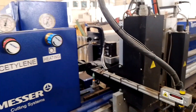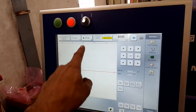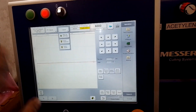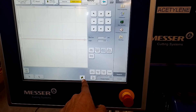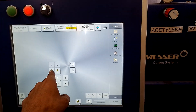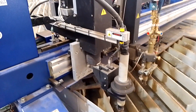It will go back. Now first thing you will do — you have two options: plasma and oxy. You have done X axis and Y axis moving. The second thing you need to check is the lifter. You have two lifters: one is plasma, second is oxy. First select plasma and you can check it by moving up and down.